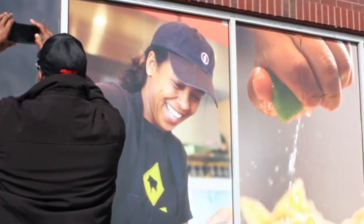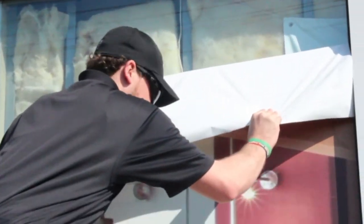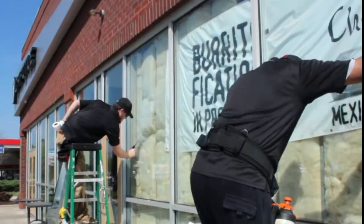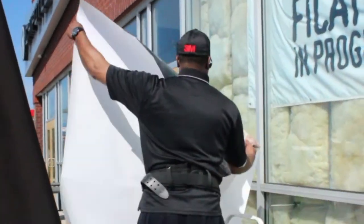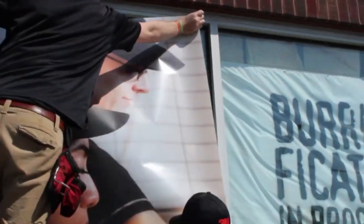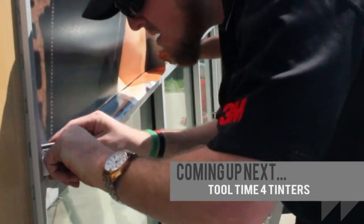My installation company had a case of serious film memory rollback when we installed a printed vinyl for a restaurant's outside windows. A couple of days after installation, we were asked to return to fix some bubbling of the film. We realized that somebody with no tinting experience had tried to fix a film rollback. We couldn't save the film — there were simply too many creases and too much bubbling. It was determined that the film had been sitting in the box for three months, and a rollback memory had formed. The film's retained memory snapped it back into place, causing the film to roll off the window.